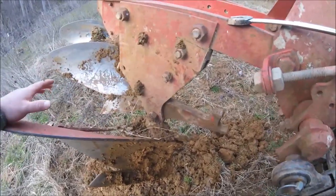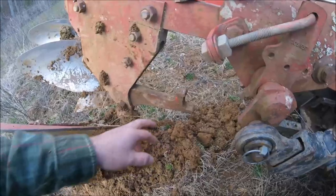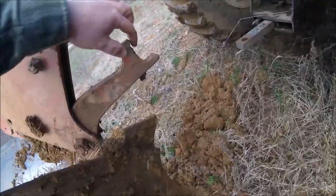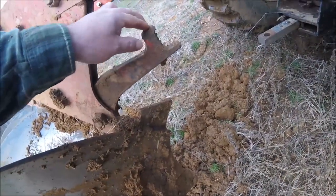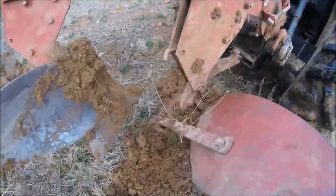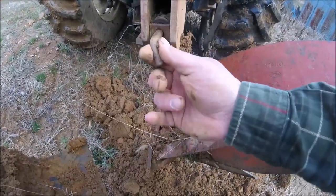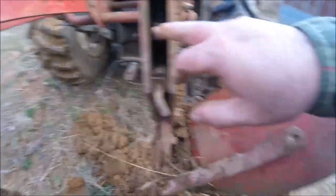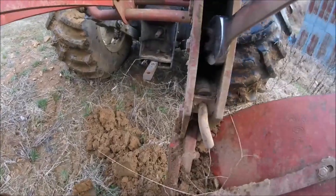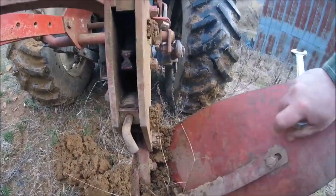So what we — couldn't trip it by hand, spin it manually — so we put it in the ground, pulled it forward. The ground is wet, and you can see that there's just a latch mechanism here that locks into the trip where it's spring loaded, and that's what holds the plow in place. You can see now that this spring — this bolt — the spring holds it back. Right here is the piece that the wrench goes on; it's an inch and a sixteenth. And see, it's tripped — you can't move it now, it's still up. And when the plow comes back, this will go down and latch it back in place.